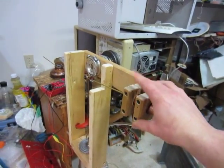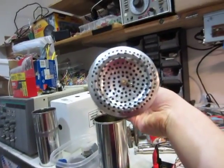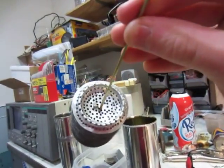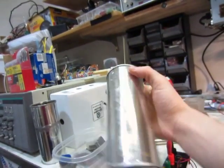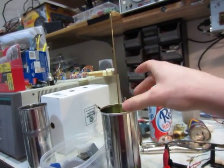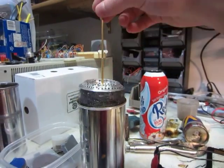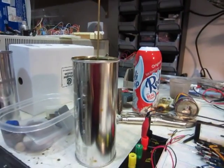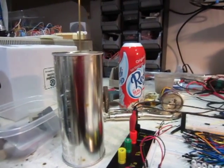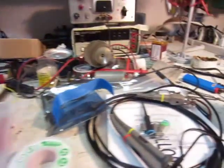If that doesn't improve it, I'll probably build a new one — I've already started it. This is the displacer there; I drilled lots of holes in it. That's gonna be the displacer slash regenerator, and I'm just gonna use one can this time, because if I connect two together the steel wool will get caught on where I connect them. I'm shooting for one watt — that might be a little high, but hopefully I'll get closer to that.